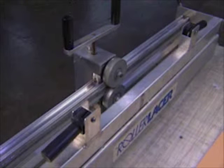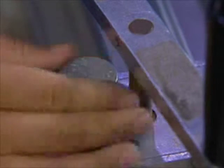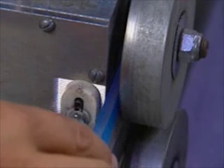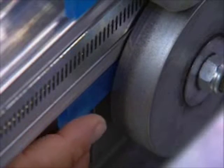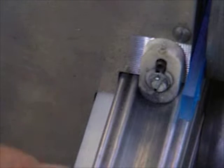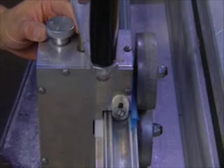There are six basic steps for replacing the guide blocks. Step 1: Do not remove the rollers. Turn the adjusting knob until the two nylon blocks fit between the roller shafts. Next, carefully insert the nylon shim between the head and the track. Adjust the knob until the roller shafts securely touch the nylon blocks.